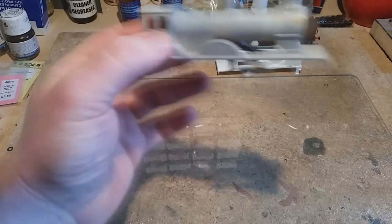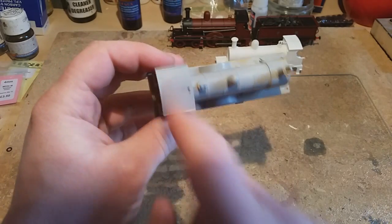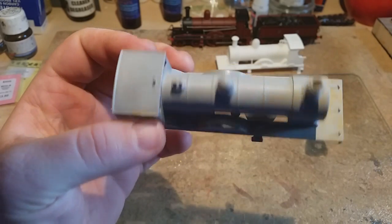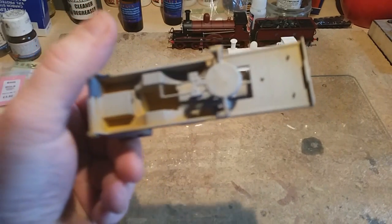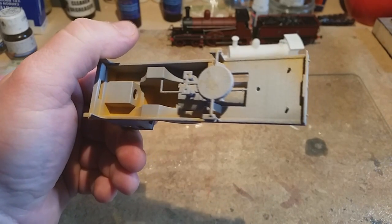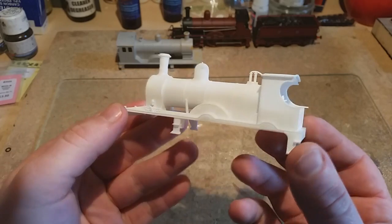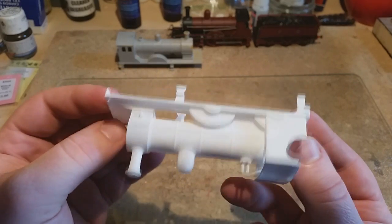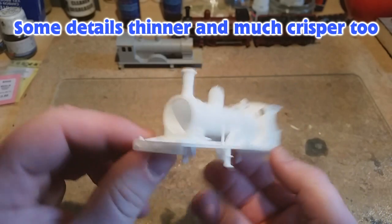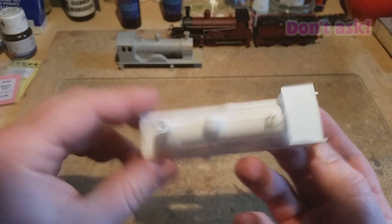So just to recap: you've got a focusing issue still — I went over this before. It's since been smoothed down, had a coat of Tamiya Primer, and I've gone over it again a few more times. It's a lot smoother than it was — not perfect, but pretty good. The underside in comparison is rather knobbly. And I've got a FUD K2 that arrived and I'm very, very pleased with it — much smoother. This hasn't had any primer yet at all, it's been soaked in white spirit for about an hour, had a slight rub down, and it's already smoother than that one. And this front plate is a lot thinner too — much better, in my opinion.